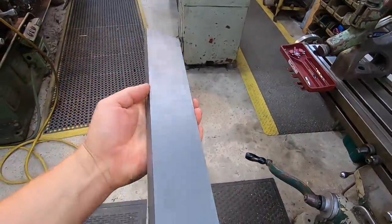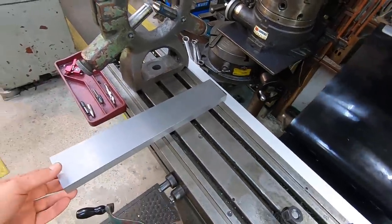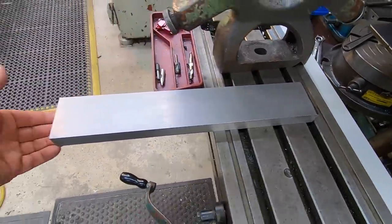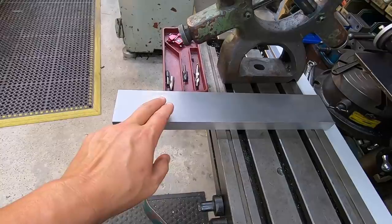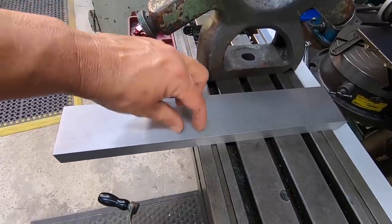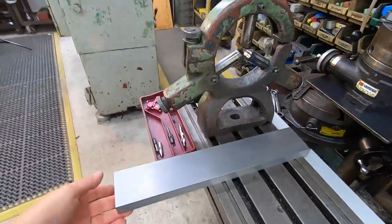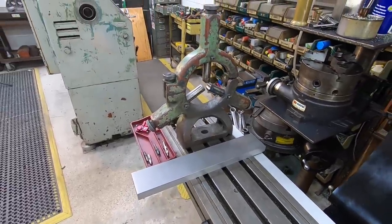Here's our finished block - at least cut to size. We've still got more to do but we're going to have to get to another video to finish that out. What we'll do is set up here and drill our two holes so that it'll bolt there in those two slots. We'll have something here to bolt it down and probably mill a little channel and put some kind of V or a piece of angle to match up with the V on the steady rest. So we'll get back to it and get it finished out on the next video.